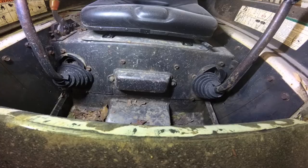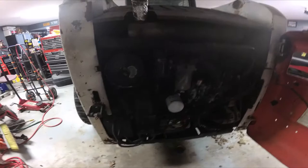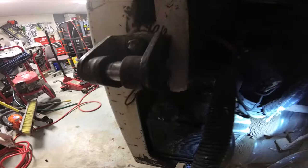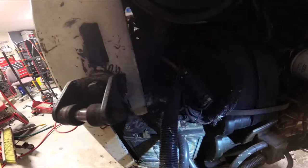It may just be my size causing it because I can't get the gate down all the way, and the seat won't scoot back — it's like the tracks are locked. I need to take the seat out and check on that. But today I'm going to get into this fuse box down here and see if the relay for the glow plugs is bad or dirty, see how much corrosion we've got. There's another inspection point in the back that seems to be a common problem with this style of machine. There's a big fuse in here somewhere. I noticed every now and then the charger light comes on, which is a good clue that we've got a bad ground. To check the charge pressure I'm going to get in here and look. There's a belt cover — when I get the battery and wiring out of the way I'll take this cover off and inspect the belt and pulley.